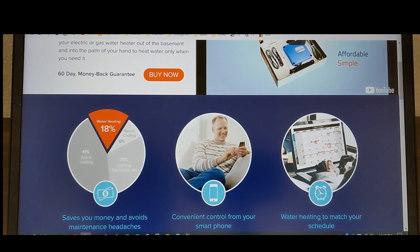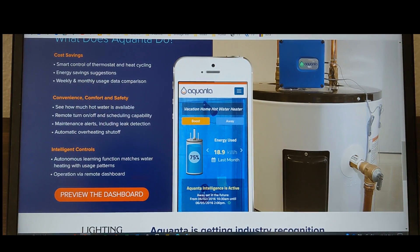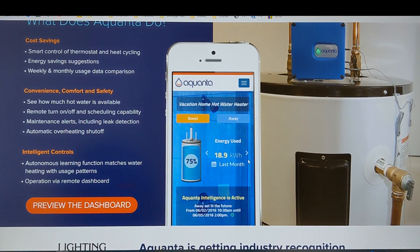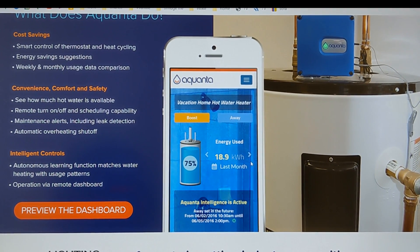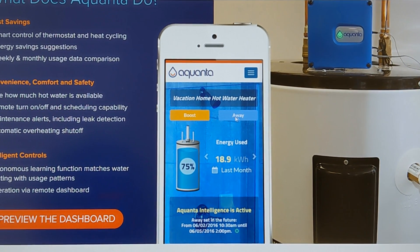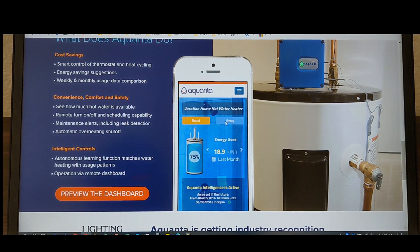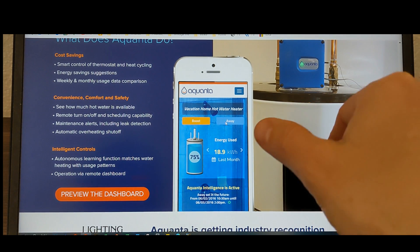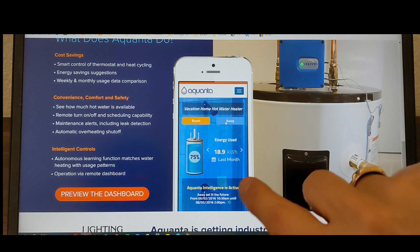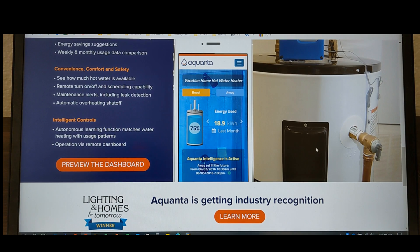It talks about your overall expenses. Typically water heating is 18% of your bill. What I also like is the remote control aspect — if we're away for half the day or going on vacation for two weeks, you just set it to away mode. It's electronic, so it'll completely set it just like you took the pilot light all the way down to away or vacation mode. It can never go higher than the physical knob on your water heater, which also makes sense for safety.